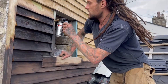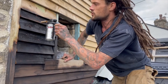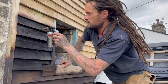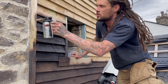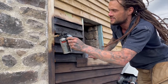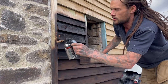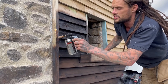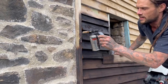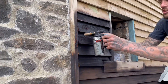You can play around with it at home and see what kind of final effect you want from a bit of timber. I've done this in the past on mantel pieces and I've done some at home just messing about. It colours to a beautiful grey colour — it's a really nice finished effect. You don't have to be a specialist; I've only done this three or four times. Some pieces of timber I've left outside just to see how the weathering affects it, and it hasn't rotted away, no termites. You can see all that resin and oil coming out of the timber there — it's bubbling up, coming to the surface. That's happening over that top couple of millimetres of all this wood.